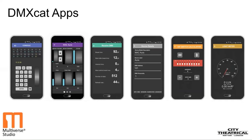Since it is app-based, we're able to constantly update its features and to add useful new functions. DMXcat is a hardware dongle and a free app you download from the Google Play Store or the Apple App Store, and it contains these apps: a DMX controller with 512 sliders or a console-type keypad for entry of levels, a fixture controller linked to a database of lighting fixtures and their various personalities. This works very much like patching a lighting console and loads an accurate representation of the controls it takes to operate any fixture in any of its personalities.